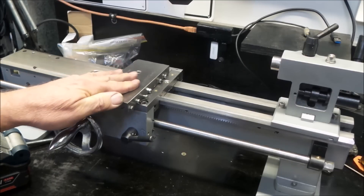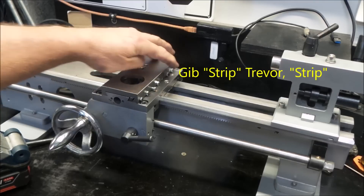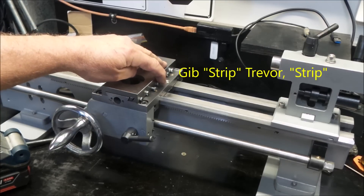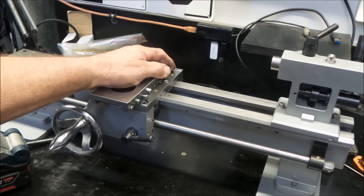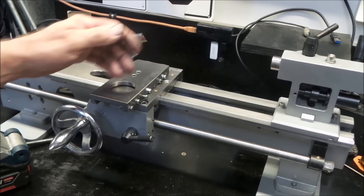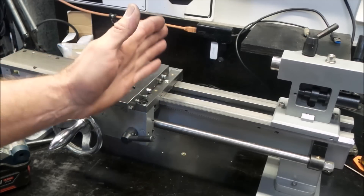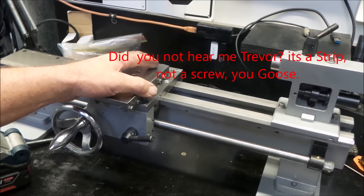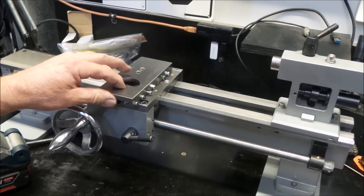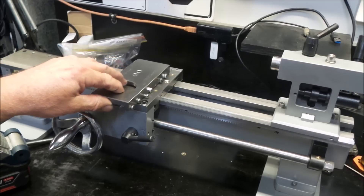While working on the cross slide I decided to add more screws into the side of the gib to stiffen it up. There were only initially three screws, which leaves a large gap between them. I really feel that would allow for movement if the cross slide is out at a point where the front edge is resting between the gib screw positions. The gib screw in these machines is super tiny, so any force could actually twist and bend it where there's nothing behind it.